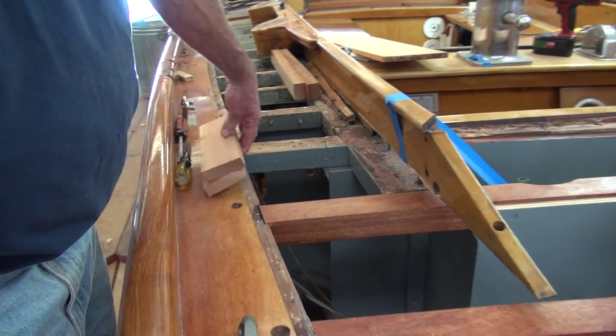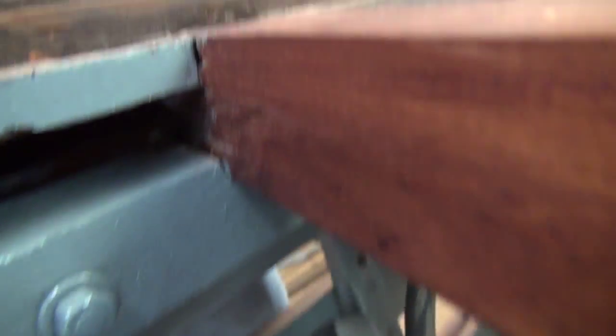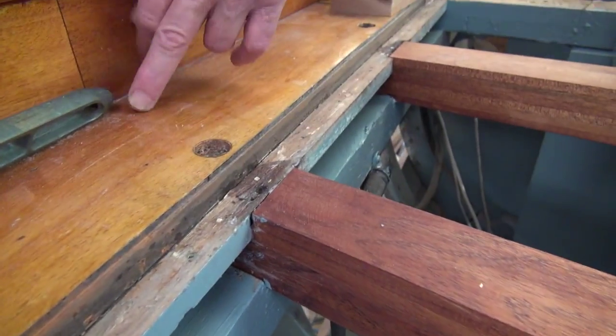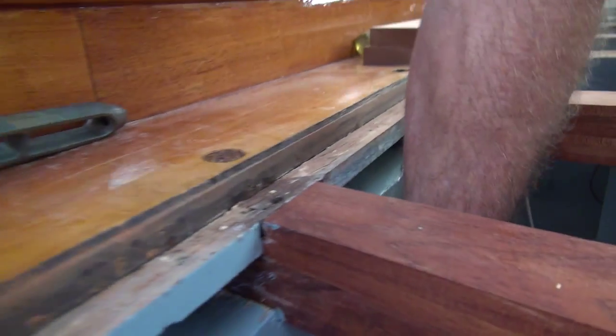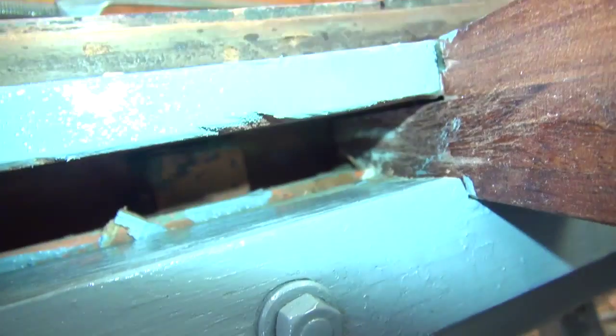The beams come all the way out to the hull, and we had to dig these bolts out. There were bolts in there — the bolt goes through the shell, and then there's another bolt about an inch in from the bulwarks. It goes all the way through the shear clamp — it's about eight and a half inches long. We were able to get those out here and up at the main beam by the cabin, up at the back end of the cabin.